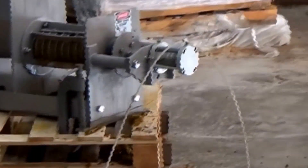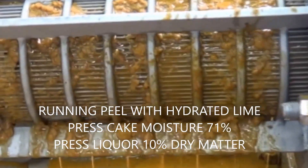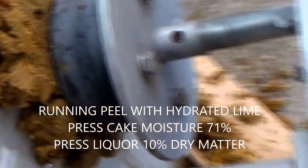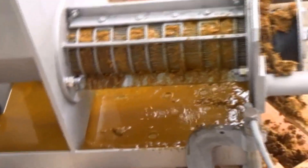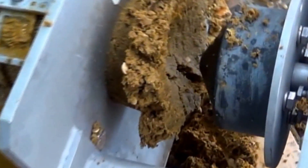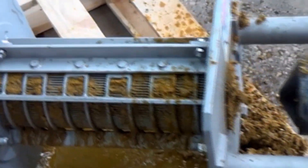I'm starting to get some peel out, close the cone, and we'll see what happens. The press is spitting some — this press liquor looks a little stronger to me. Cake is coming out all the way around the cone. I'm still at 2 bar pressure, and it feeds pretty well on its own accord. The liming operation broke up some of these pieces of peel.